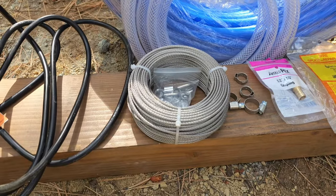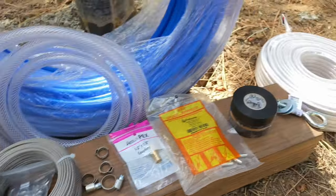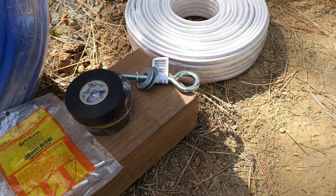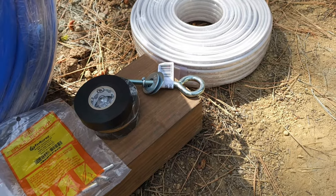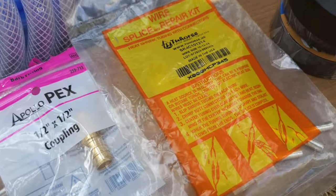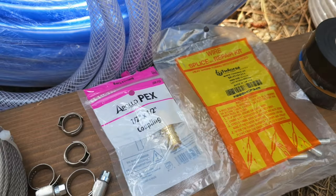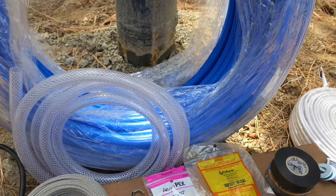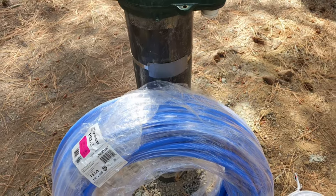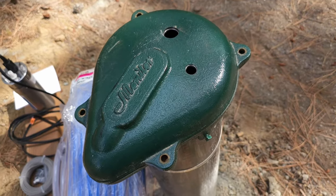Our safety line is an eighth-inch stainless steel cable with all the connections. We also have an eye bolt that goes with the safety line — that's going to go through our well cap and secure the safety line so we don't drop everything to the bottom of the well. And we have our wire, and to splice that wire to the well pump wire, we have this waterproof splice kit. I'll put links to all of this down in the description. The total on all this cost me less than $400, and that actually included a new well seal that didn't come in time, so I've retrofitted the well cap we have to work for what we need.